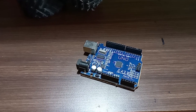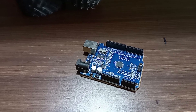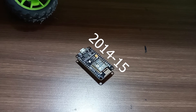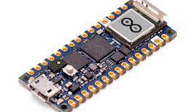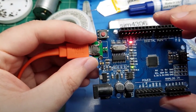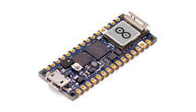Arduino does not have some advanced specifications like I2S, CAN, or Bluetooth, so it is not directly comparable with the ESP32. But I still love Arduino because of its simplicity. Arduino was introduced in 2005, ESP8266 in 2014 or 2015, and ESP32 in 2016. If you compare the latest Arduino RP2040, which has very high specifications like 16MB of flash memory, input voltage of 5 to 21 volts, and Bluetooth connectivity, then it is far better than the ESP32. But it always depends on you. If you are a beginner, you should go with Arduino Uno, or you can purchase Arduino Nano or ESP8266. If you have good experience in electronics and programming, or are working on a big project, then go for ESP32 or Arduino RP2040.